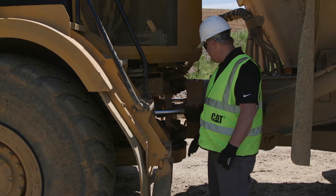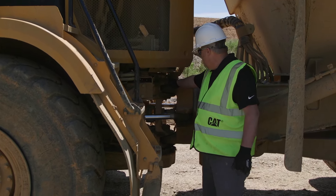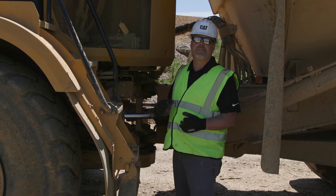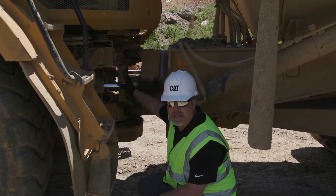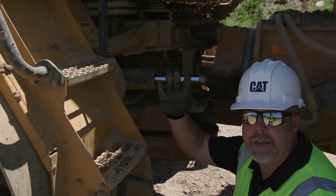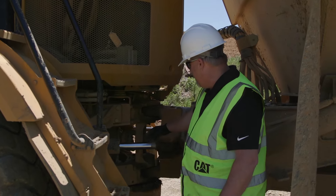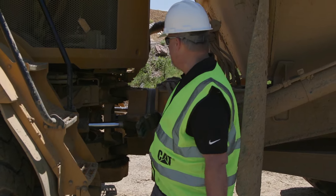I always want to keep that clean any chance I can get. I want to look inside my cab mounts and make sure those are all in place. I've got a bank of grease zerks right there, making it easier for an operator to do his daily lube and inspections from the ground without having to climb up on anything. I also want to get down and look at my articulation hitch — this is what allows this truck to flex over independently of the cab. I want to make sure all the bolts are tight and nothing is going on with that hitch. I can also see my drive shaft inside, so I want to make sure I don't have any debris built up around that drive shaft.